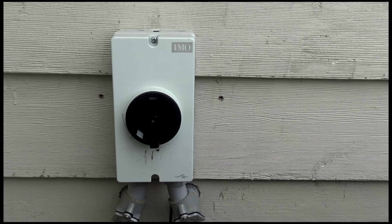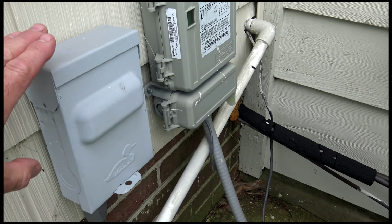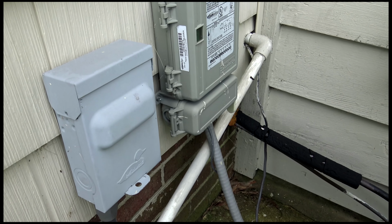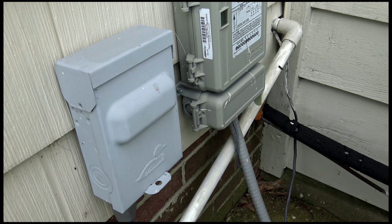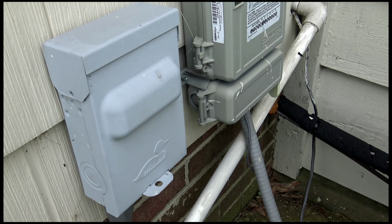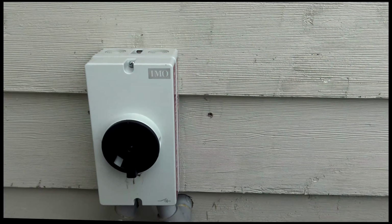Not difficult, and they're readily available and affordable and easy to put in, but it just has to be something with an appropriate DC rating. The other thing is that, originally this was probably too small anyway, because these are typically 60 amp fuses, and on my installation I'm importing a lot more than 60 amps. But of course at the higher voltages that would be coming in, closer to 400 volts DC instead of 240 AC, I wouldn't be flowing that many amps. But you still can't use this because the fuses don't have a DC rating. And if you do get proper fuses with a DC rating, they're much larger and wouldn't fit in this box, so you have to do something different. By far the easiest solution is just to get a DC cutoff switch.